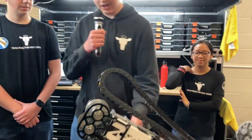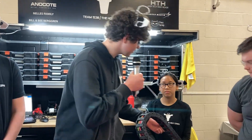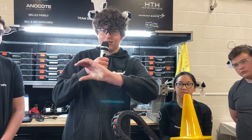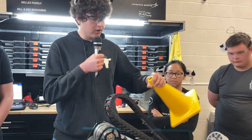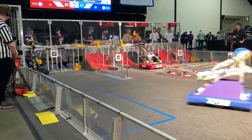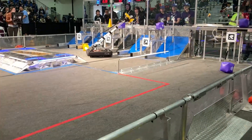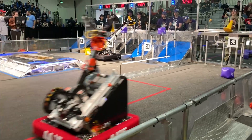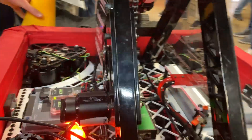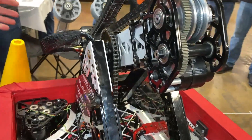So we have an A-frame. One of the goals when we were designing our robot was to keep it functionally symmetric. Because of this, we do not have a wrist that allows us to rotate. Instead, we can pick up a cone upside down off the field and flip it around because we are symmetric. The A-frame has a pivot at 18 inches, and it is powered by a Falcon down here. We made sure to have an only partially going-through shaft because we wanted the full range for the telescope.